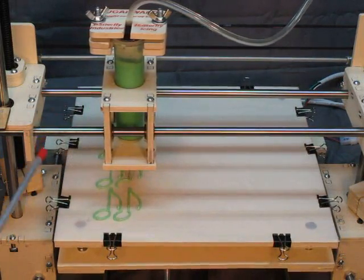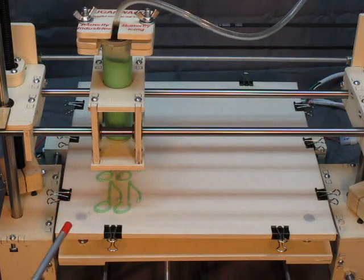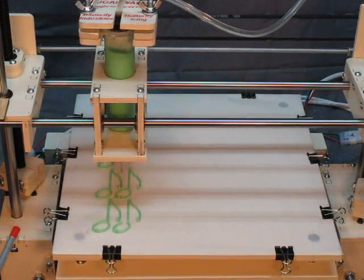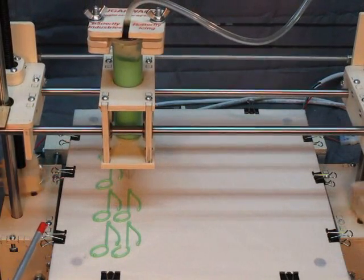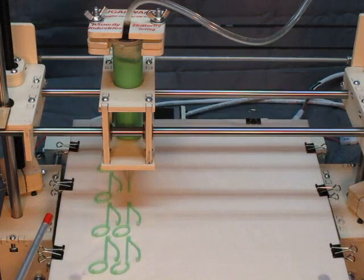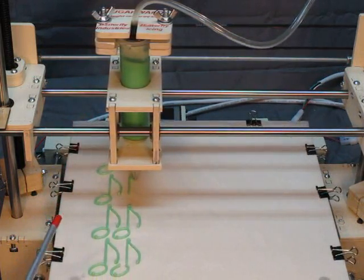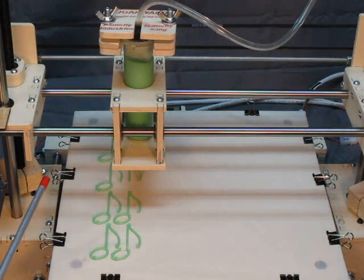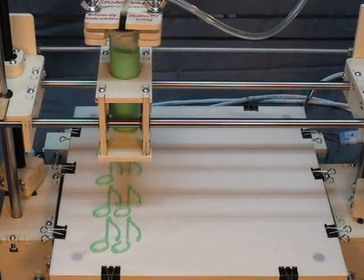The change from the original design of the bearings to this bearing design was one of the things that we were able to do to reduce the cost of construction of this device. The bearings that were in the original machine would hold about 3,000 pounds of weight. These bearings will hold something in the order of a couple of 100 pounds of weight, but this thing is so light that you don't need the heavy bearings, so you can use these, and they are about 1/10 the cost of the other bearings.